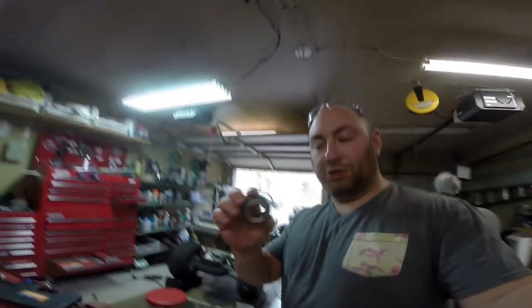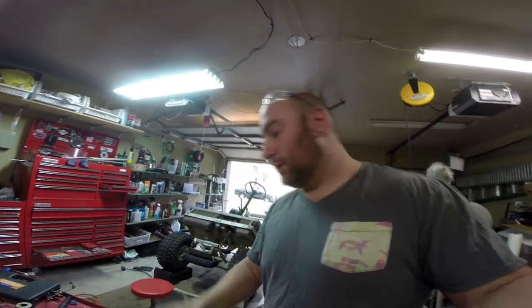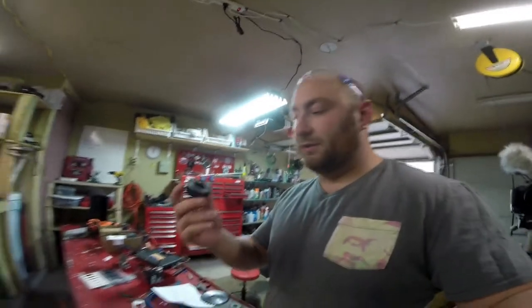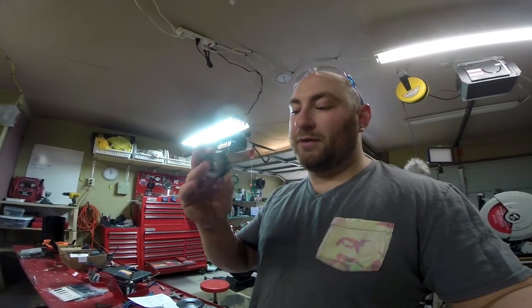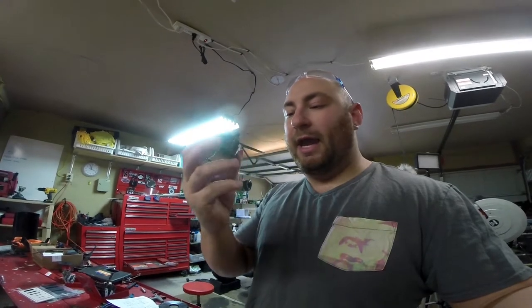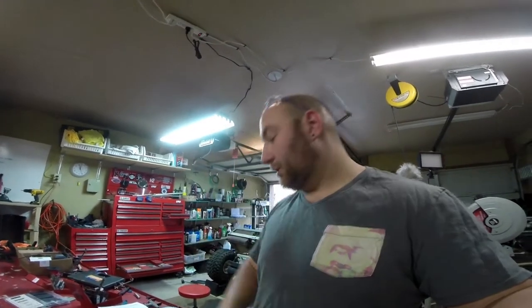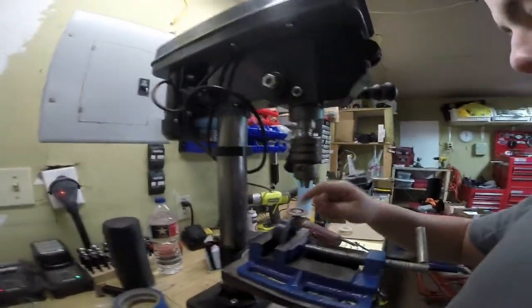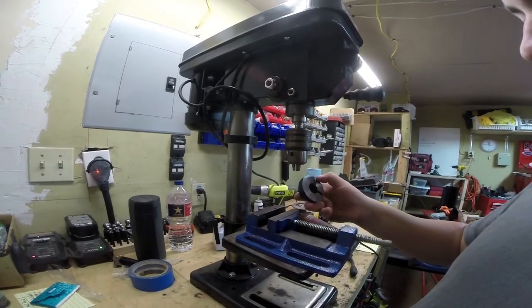Yesterday I had a chance to go to the Top Secret machine shop and machine these — these are the center pieces for our weld-in sprockets. I turned them and faced them down so they are the same thickness as this and the gear faces are flat. There are two sets of cutouts: these were drilled and tapped for retainer bolts. One of the retainers lines up with our cutout for the keystock, and the other one is just for stabilization. Since we had to face these off and they're no longer usable, I'm going to drill and tap two more. The larger one is the one I'm mostly interested in using — you can see where this was drilled for the keystock — and we're actually going to drill the opposite side first.